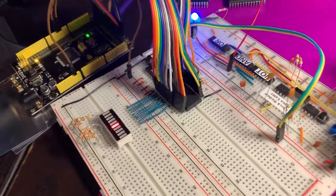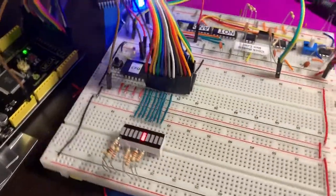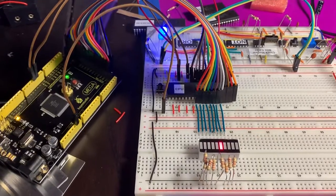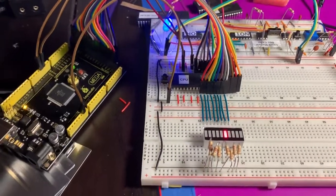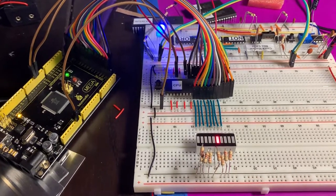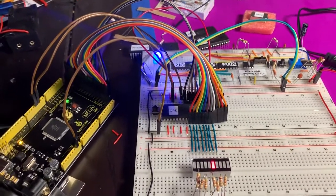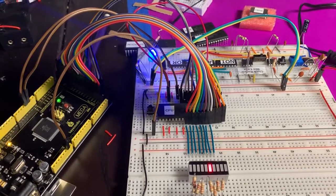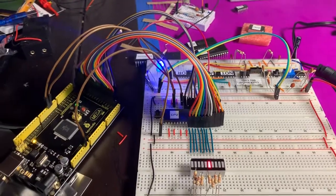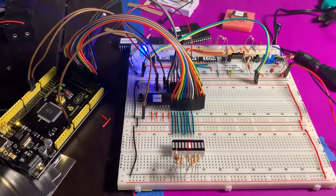The EA hex value is an operation code that says 'do nothing.' So the CPU is constantly asking what it should do at each address, and I keep telling it to just do nothing. So fun stuff — I built a computer!